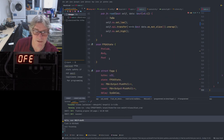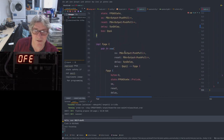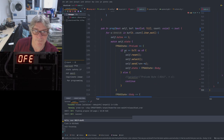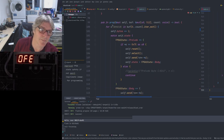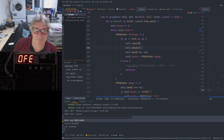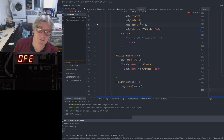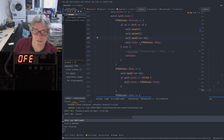So the FPGA structure now has some state, among other things, and number of bytes, because it has to keep track of what's going on. We now call program every time we get data in from the USB device. It gets passed into here, and basically then we've got a simple state machine for the programming. The FPGA state has a prelude first, which automatically does the signature detect, which then resets and pulls down the select on the FPGA. Then it moves into the body state,